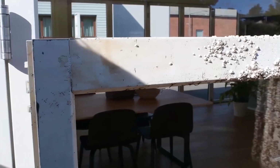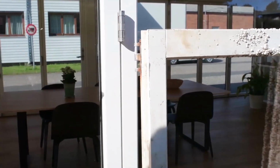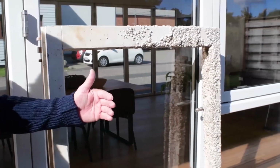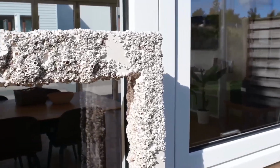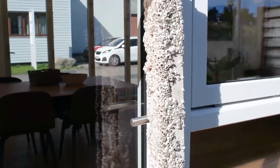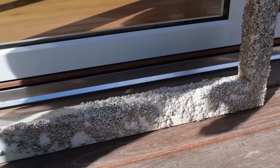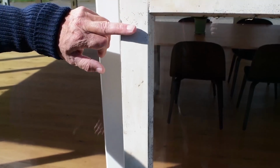Obviously, the individual panels in a folding door cannot expand as they need to fit together. We see the maximal acceptable expansion at 0.5 millimeters. This panel has expanded a bit less than this limit of 0.5 millimeters, despite laying on the bottom of the harbor in Kerteminde for an entire year. The scraping of the paint is from the ropes that attach the sandbags to the panel.